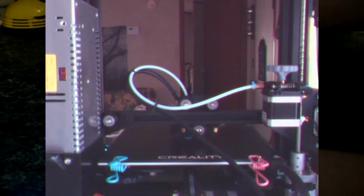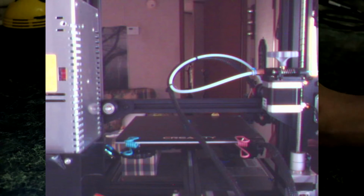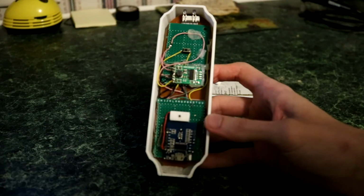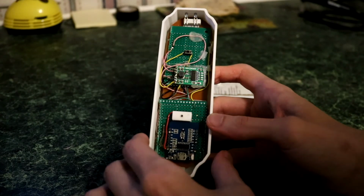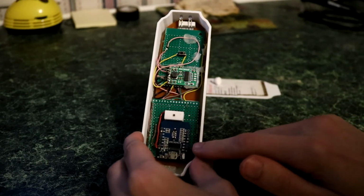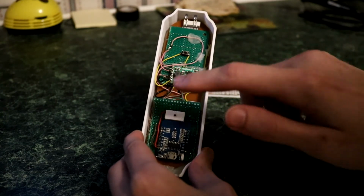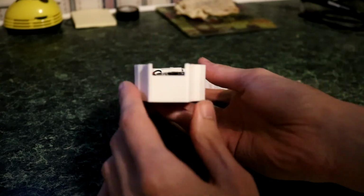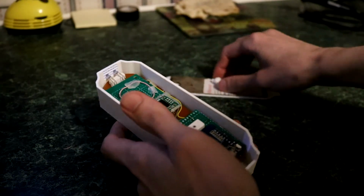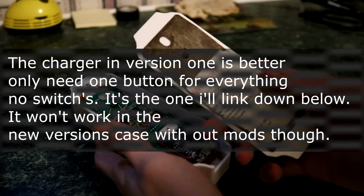Essentially I took the buttons I didn't use and I wired them up inside this unit, as well as the 3D printed buttons, and I decided to do this just to save on waste. I didn't want to waste any parts from the previous project, so that's why the button's blue. Anyway, the charging circuit came from a salvaged broken 5-volt USB power bank. It wasn't labeled, but I'm guessing it's 1 amp output only, which explains the brightness of the IR LEDs.